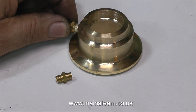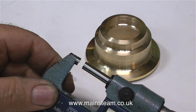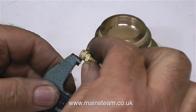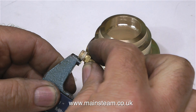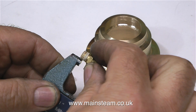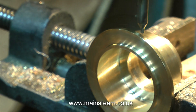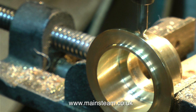This super heater stroke chimney mount is going to have four connections in it. To illustrate this, I'm going to use some commercial fittings, but these are not the right size — I need to make special one-off fittings, and I'll be detailing this in another episode. The first hole to be drilled in the piece is the one for the wet steam inlet. I'm drilling almost all the way through with the centre drill first.